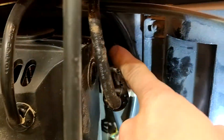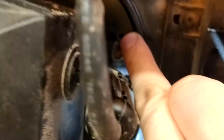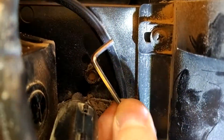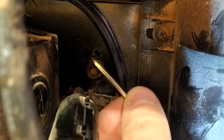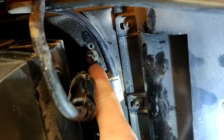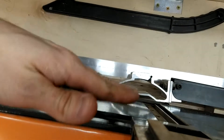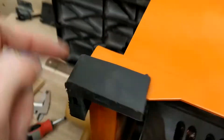You can loosen them, and there's a smaller hole where you can put in your allen key. You loosen this screw and then you can adjust the height of all four corners. If you use this screw it will lift or lower that corner of the bed.